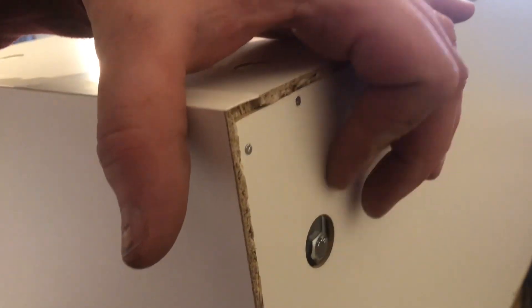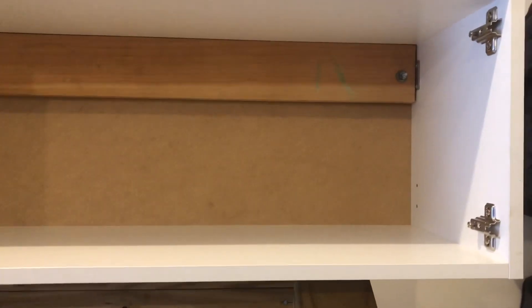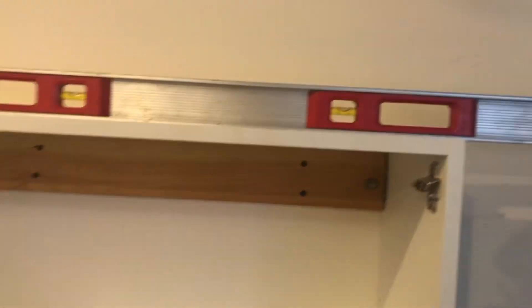When I assembled the first cabinet I put the white side out — I should have put it in. I didn't notice it had two colors until I got to the second one. Oh well, the instructions don't mention it. I got the first cabinet screwed into the wall; I used my level, screwed the cleat into two studs with two-and-three-eighths-inch cabinet screws. It's at a good height — easy to reach from the workbench and doesn't interfere with any operations on the bench.